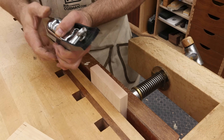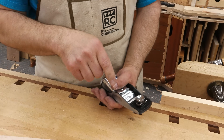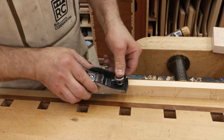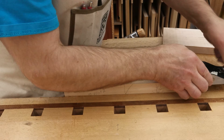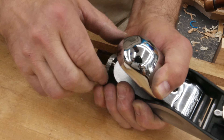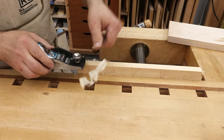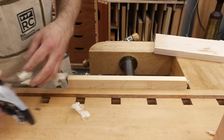That's a bit heavy for maple. I've got a piece of pine in here — I want to check and make sure that my blade is parallel to my sole. I'll take a fairly light pass, then go all the way to the left side, then all the way to the right side. It's a little less on the right, so not a big adjustment. I'll pop off the lever cap but keep a certain amount of pressure and then ever so slightly shift the blade until both sides are about the same.